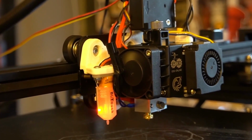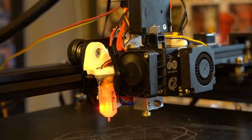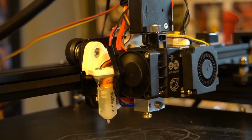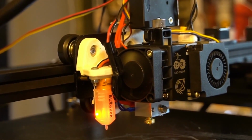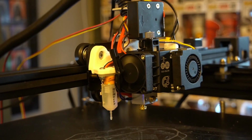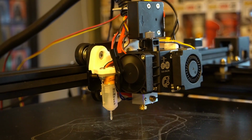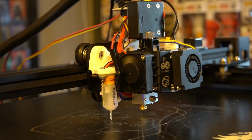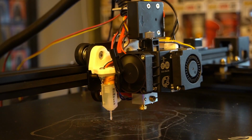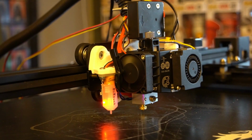It, dual drive, can be mounted as a direct drive. Mounting is easier than most. Its price point at £108. Core competencies mean that you can push the envelope when it comes to alternative filaments. 10 kilos of pushing power. And comparing this to the Bondtech DDX and Slice Copperhead, you're going to be paying 3 times the price for that other setup. In short, the Hemera could be a clear winner here if it wasn't for having to mod the code, and if you had to do this as a novice, I would have concerns.